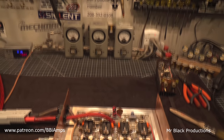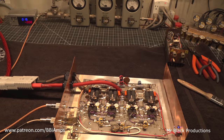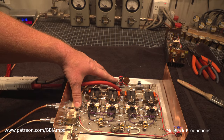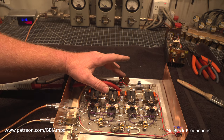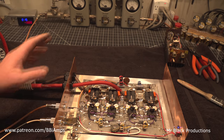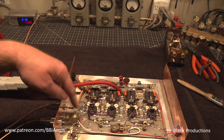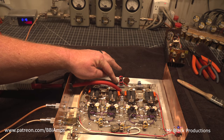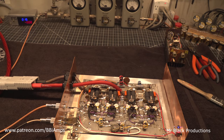Right now this thing has easily outperformed a messenger amplifier. It has a lot to do with the turns ratios, the transformer, and the capacitance. You've got to remember there's six inches of coax here, so if you set up your antenna in a mobile, instead of 12 and a half feet you're going to have 12. Because as far as the amp is concerned, this is the end of the amplifier. The tune point on this amp is at the final combiner — that's where we're at with our capacitance — taking it from 100 ohms down to 50. This thing is done.